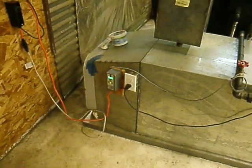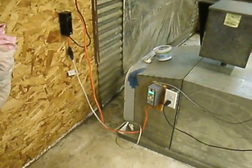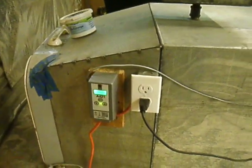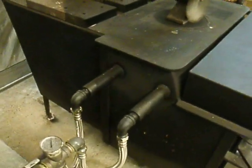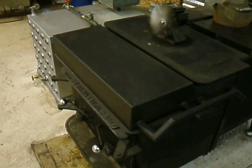I've got a small 20-inch fan in the back that's run through a thermostat on the wall, and it kicks on at 70 degrees. There's another thermostat that's digital, hooked up to the water pump. The water pump takes water out of the top, runs it through this pipe, down through a pipe — I cut two holes in each side of the stove. The water runs through over to the other side and then goes into this box which sits on the front of the stove and holds about five gallons of water.